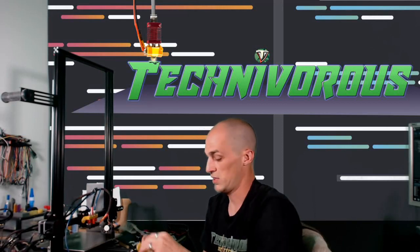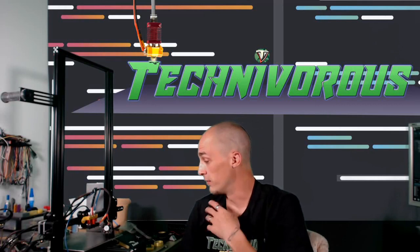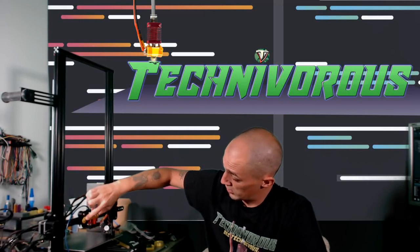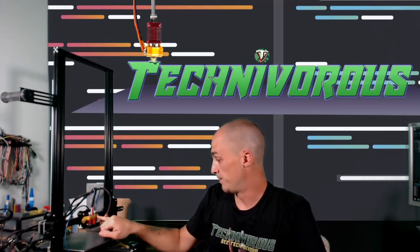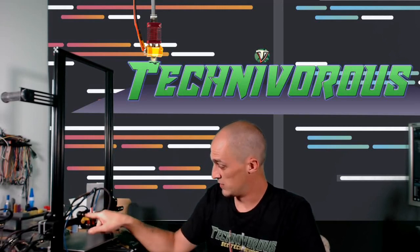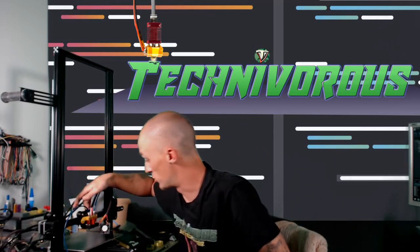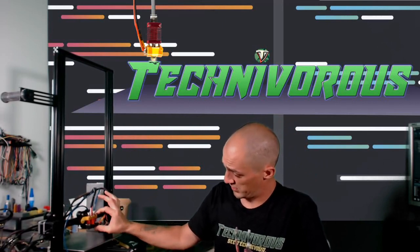We are making progress. I'm going to go ahead and edit this part, and I will have another video up when it is done printing and we attach it to the machine. But for now, I just wanted to give you guys a quick update on the dual extruder that we're working on. As you can see, there is no wobble — it shakes the whole machine when I tweak one of these, so they are pretty sturdy in there. These two bolts right here don't go all the way back; they are threaded more into the plastic to hold this stable. Eventually I will be getting some longer ones, and we will tap out two extra holes and get some extensions like we have on the other two main bolts. But these two are braced in there and pretty tightly connected.